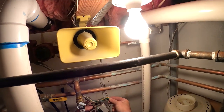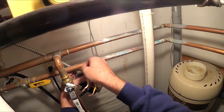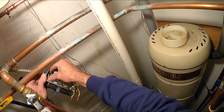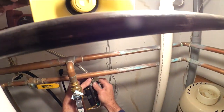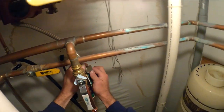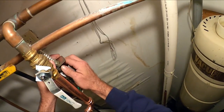Wire. That's only a small, less than 1 amp pump. Actually, the pump's too big for what we're doing. For some reason, people think the bigger the better pump. No, where's your pipes out? Especially on recirculation. And honestly, it's not even the right pump. It's a cast pump, not potable. See if they want to change it, but I doubt it. It cost them like $700 or something. I don't know. Bronze pumps aren't cheap.